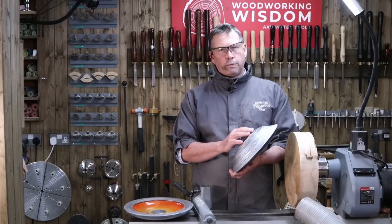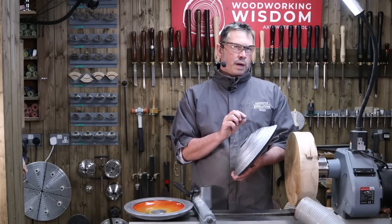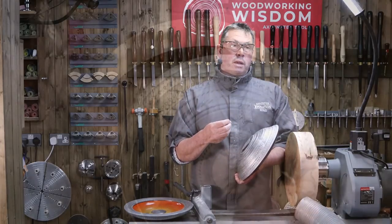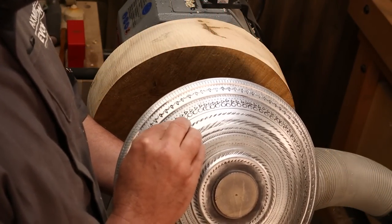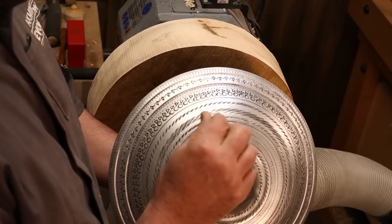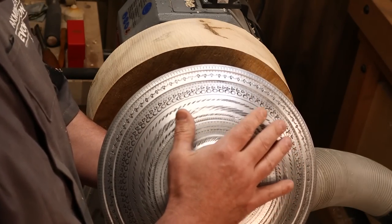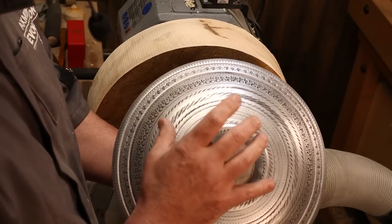The silver effect that we've got on the back takes a lot of time, going over and over with lots of coats. If you do one single coat quickly and thickly, you'll fill in all those lovely patterns that you've made. And that's one difference between CHROMA gilts and things like decorating waxes. Decorating waxes and things like liming wax, all those sorts of things, fill in the indents. With CHROMA gilt, you pick out the high spots. You want to leave the indents. So that means you have to put your CHROMA gilts on very sparsely, but with lots of coats, just to get that solid colour. And when you do that, you get a lovely single surface, non-patchy at all, so it's worth taking your time. It gives you a very dense look.